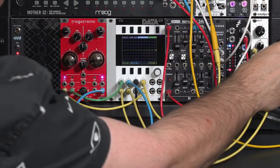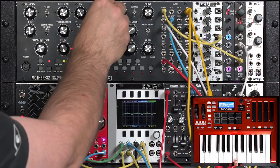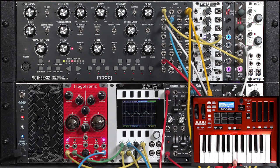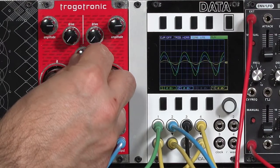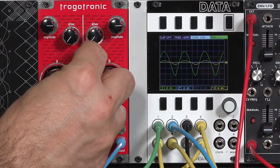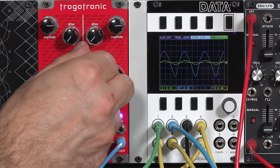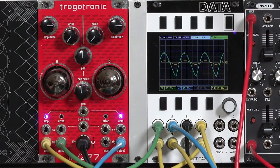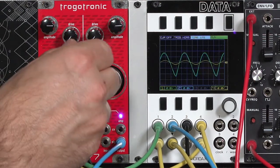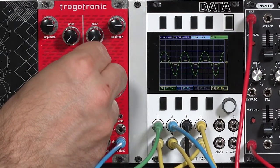Going over to my right channel here — there's my processed sound. If I change the pan control, you can see how the green waveform on the left is different than the blue waveform on the right. It's the kind of panning circuit where at the center they're both equal power, and as you fade to one side, one channel stays the same loudness while the other one fades out.